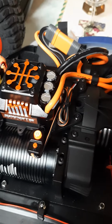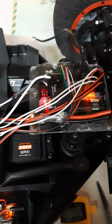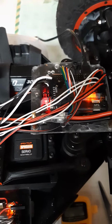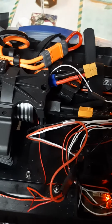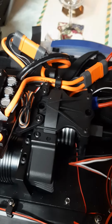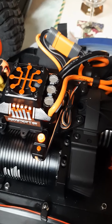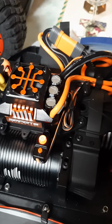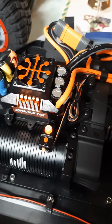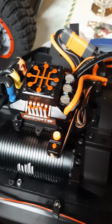So everything checked out. We calibrated through the radio this time, set our mode switch, which is mode switch F, to manual, and smoke checked it, made sure there wasn't anything that was burning up, and went through the ESC calibration, which was to press the set button at the same time you're holding down the power on button, neutralize the throttle, and then press the button once. That sets and locks in, get a little green beep.